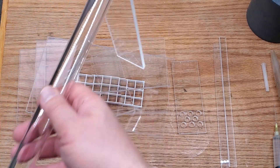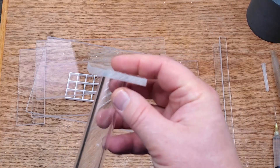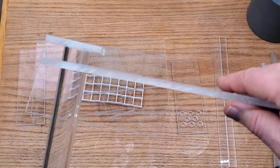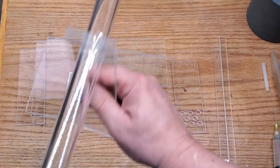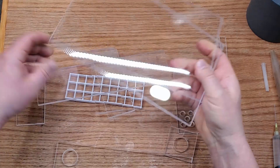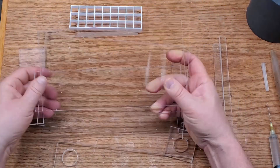These two pieces of drilled acrylic are going to form the brackets for the standpipe. The bottom piece is a friction fit — loose enough to remove but not loose enough that water will bounce it out. The other one is the lid, and it's considerably more loose. I was initially planning to use those thin strips of acrylic to make a bracket the lid would slide through, with the standpipe acting as a locking mechanism. It was an interesting idea.